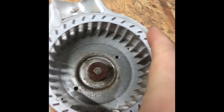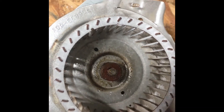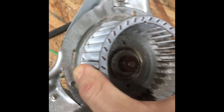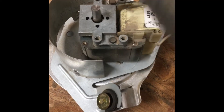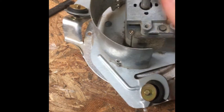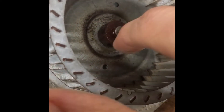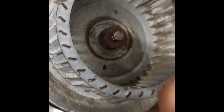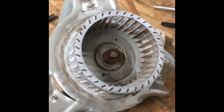This thing was kind of a pain from being in there, heated and cooled, just rusted. The easiest way I could figure out without more heating: I sprayed it well with penetrating oil, and since I already have a replacement motor, I just hit the shaft on the back to punch it through — it just won't come off by itself. So now the shaft is pointing out. I took a little sandpaper and hit that edge, and I think it's going to come off in a few more hits.